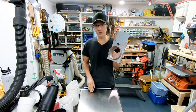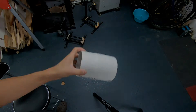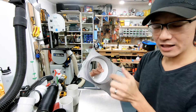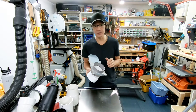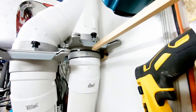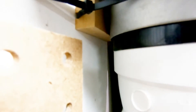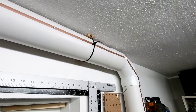Connecting the blast gate to the network: because we've chosen a 5-inch blast gate, we need to use the larger female end of the fitting or the female end of a 10-foot PVC pipe. Check this out — it just fits, just like that. The fitting comes up about a quarter inch to the blast gate surface. Sometimes I use a layer of Gorilla Tape to seal it a bit better and get a snugger fit, but right off the bat it's pretty good. For mounting, I use a small block of wood with a channel in it for a tie strap, screwed into the wall or ceiling. The flange of the blast gate sits on the block of wood while the tie strap keeps it tight.